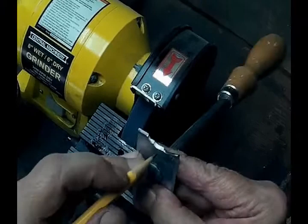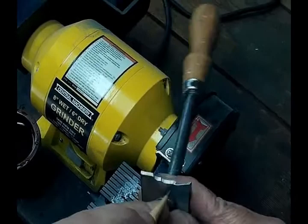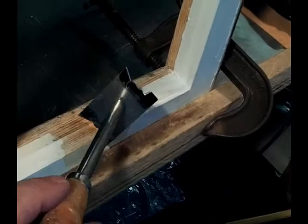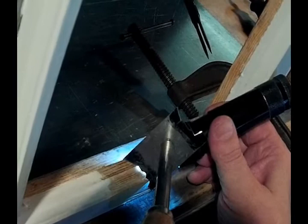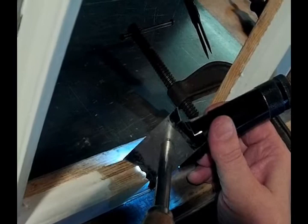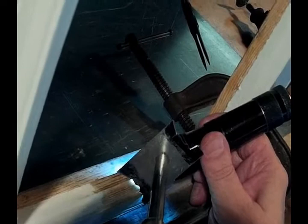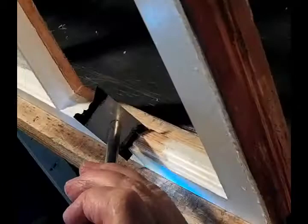You can see that's the 65-degree bevel and here's the 90-degree bevel. Over here this will be a safe edge, and this will be a scraping edge. Then I check the profile back on the sash — hold the scraper handle at the correct angle and shine a little flashlight behind the scraper blade. You can see where the light is shining through between the edge of the scraper blade and the wood profile on the sash. If it's still way off and not a close match, you may need to scribe the wooden profile onto the scraper blade again and do the rough grinding again.